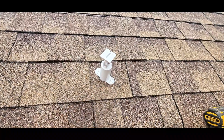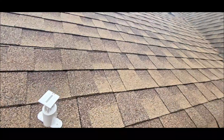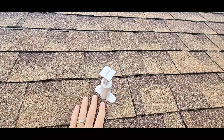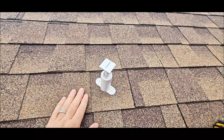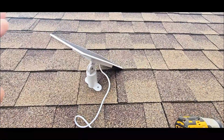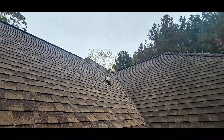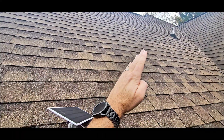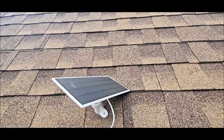It's actually at an angle, and here's why. This tilt is going to go this way. My sun comes from up there, so keeping in mind where your sun direction is is going to help you get it pointed in the right direction once you get it mounted. As you can see, having that tilt facing that way allows me to tilt it directly up. In the winter we get sun kind of at an angle, so that's going to allow me to get maximum sun exposure on the solar panel.